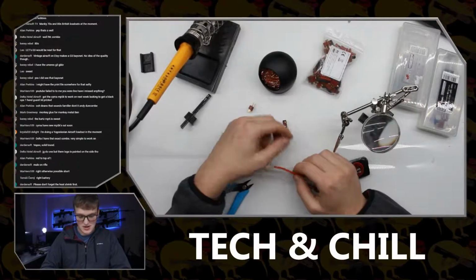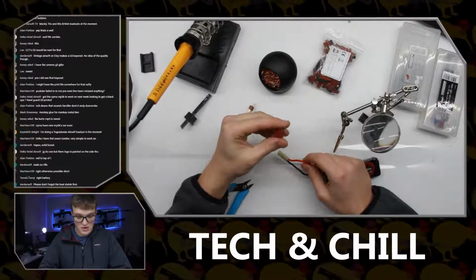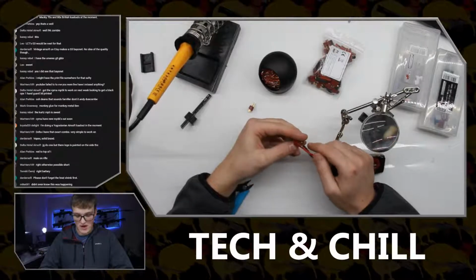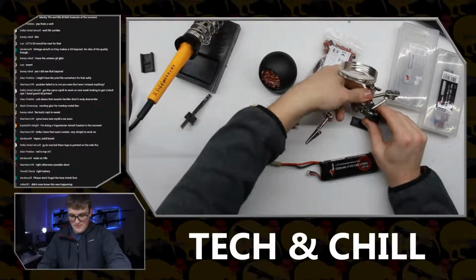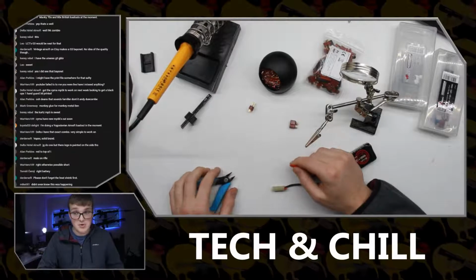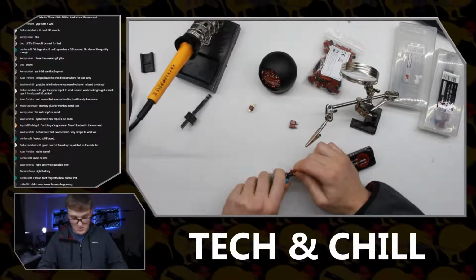One wire, earth first. Now, most of the time I would agree with you, earthing first is good, but batteries we don't really earth because they're isolated systems. And on this one, I tend to do positive first because I find it a bit easier to solder negative on these than positive. To get the positive out the way and then put the negative on. So, without further ado, let's trim the positive, and we're going to give them as much wire to work with as possible. Now this is where you get your wire strippers. Remember the separate tool, your wire strippers, and you're going to strip some of the heat shrink off using your wire strippers, definitely not your side snips.